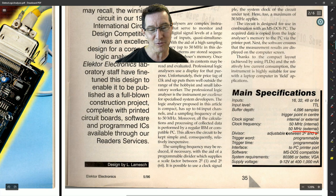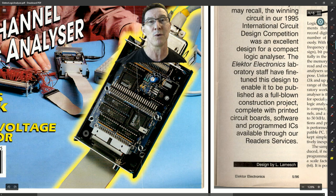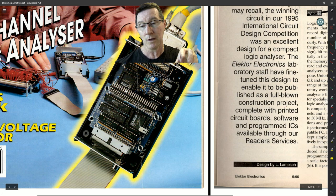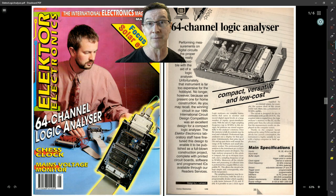It's also a PC printer port interface, just like mine. But the form factors are significantly different. Mine was built into one of those PacTech cases; this one was more compact and had multiple boards. The huge difference between the designs is that this one used double-sided plated-through boards — mine was a specific single-sided design. That's a huge difference.